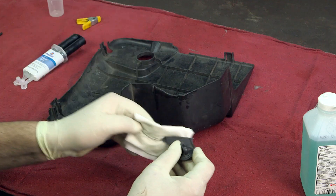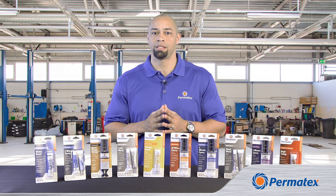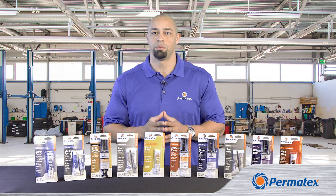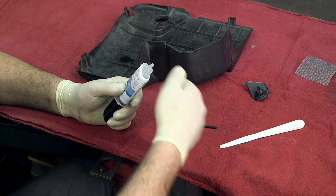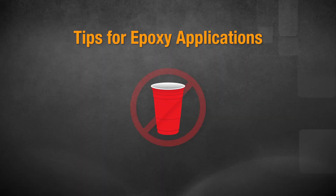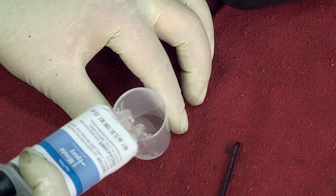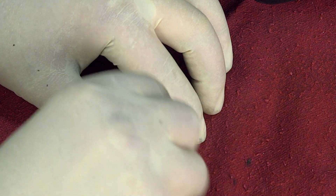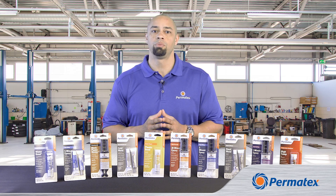So we've done our prep and double checked our timing, and we're ready to mix some epoxy. You'll need something to mix with, and our epoxy syringes have a plastic breakaway mixing paddle in the center of the plunger, which needs to be removed before dispensing. A clean popsicle stick also makes a good mixing stick and it won't react with the epoxies. If you're going to use a cup to mix in, make sure it's something you can throw away when you're done. Epoxies can really heat up when they cure — a plastic cup may actually melt from the heat and let the liquid leak out. When you're mixing epoxy, use a decent amount. If you try to mix just a tiny bit, it can be hard to get the 50-50 mix of liquid and hardener that you'll need to get a successful bond. Our syringe dispensers make it easy to get a 50-50 mix, and their sealing caps keep the two parts safe between uses.